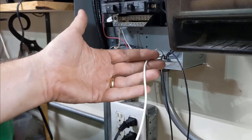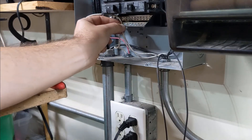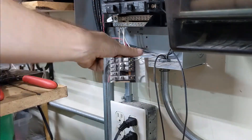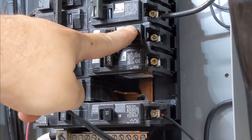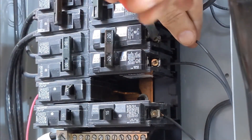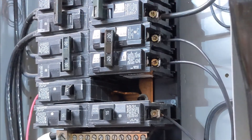All right. We've got a common and two live wires. Common's just going to go up to this bus bar. Each one of the live wires go to a terminal on the breaker. Do a tug test on them — make sure they don't pull out.